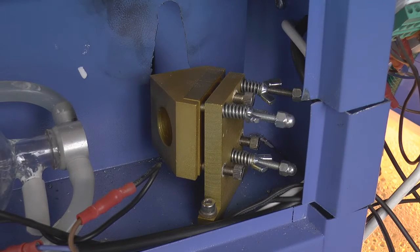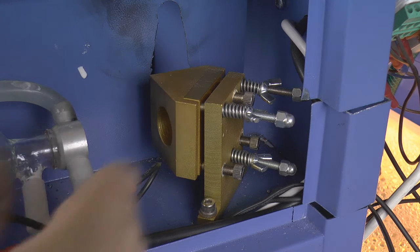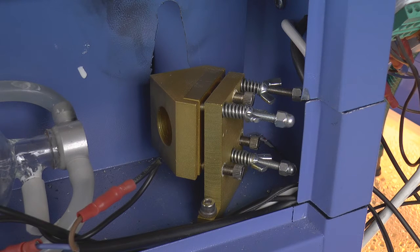The other essential thing we must do before we start is remove any calibration or adjustment that's already on this mirror. I've got a 3mm spacing pin which I've used to set up this block in all corners so that it sits with a 3mm air gap behind it. That gives me maximum amount of float to set this up when we come to set the mirrors. But the whole principle of this system is really don't touch the mirrors — we're going to touch them very small amounts at certain key points. The principle is to leave this mirror set at its nominal 45-degree position and use the laser tube itself as one of the adjustable elements.